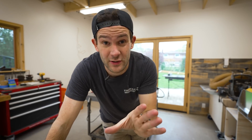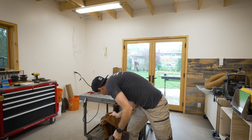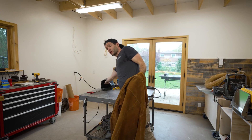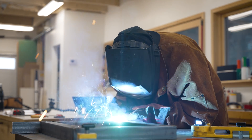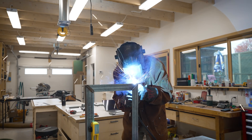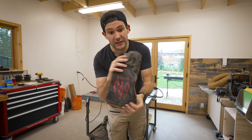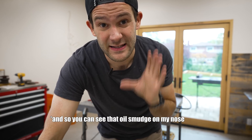Okay, just give me 30 more seconds — I want to talk about one more thing and then we can actually start welding. You are going to need three very important pieces of safety equipment before you start welding: a helmet to protect your eyes from the bright light of the welding bead and to keep your face free from sparks; a welding jacket to protect your torso from the intense heat and any sparks; and a pair of gloves to keep your hands safe. Please — I am zooming in for emphasis here — do not skimp on any of these three pieces of equipment. You are dealing with crazy temperatures and I would hate to see one of you get burned just because you tried to save a few bucks on welding gloves.